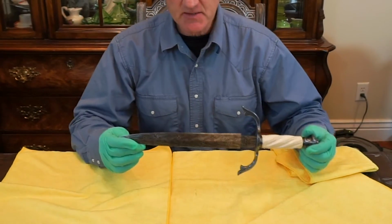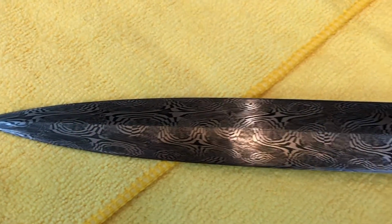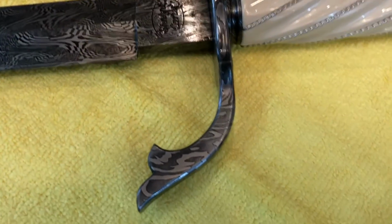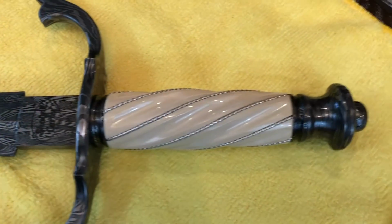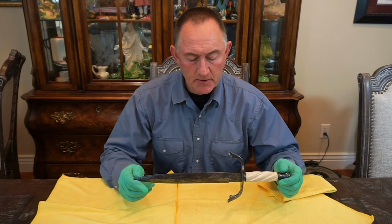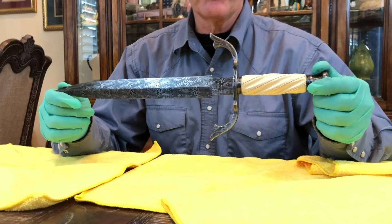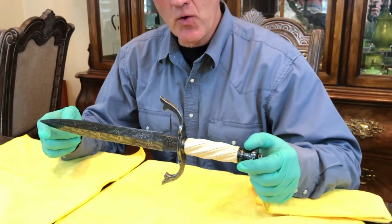So the Damascus blade: I had a 9-way bar that I forged out, a 9-way square, into 4 separate billets, twisted it opposingly, and welded it together. I used that same technique on the tip as the D-guard. There's 4 different types of steel in that. In the checkerboard, it's L6 and 1080, and then in the W's pattern part of that blade, it's 15N20 and 1084. It's an 11 3/4 inch blade.